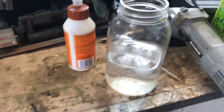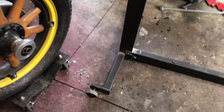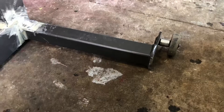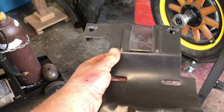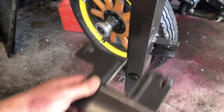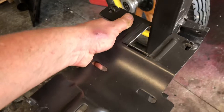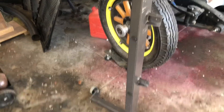Welcome to the garage today — just soda water, not gin and tonic. This is a continuation of that earlier video where I was working on the motor and grinder. What I've done is taken apart the old treadmill and welded it into a T-shape for the base. I've used the existing system where you can lift it up and roll it on these wheels, which is really convenient. Right now I'm taking this motor plate — the thing that holds the three horsepower motor — and I'm gonna mount it in there using this existing protrusion and bolt. It'll slide in and bolt down, giving my motor a place to sit on this frame.